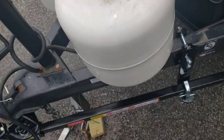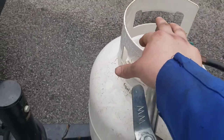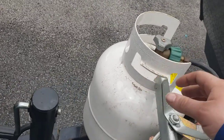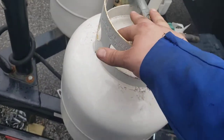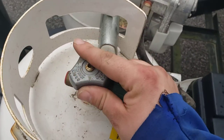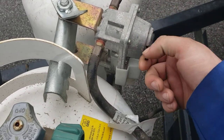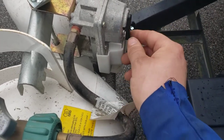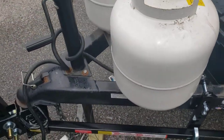Dual 20-pound cylinders. The auto-changeover regulator is pointing this way — it's going to pull from this tank first. Once this one is depleted and you have the other one on, there's a little diaphragm in here that'll open up and switch to pulling from that tank. Keep in mind this indicator doesn't move to show it's switched. Also, somebody will split it in the middle thinking it's going to pull from both tanks equally — but it does not work that way. It's one or the other.